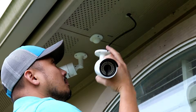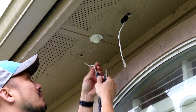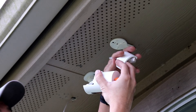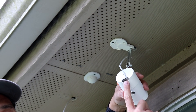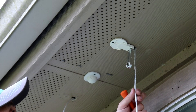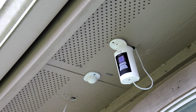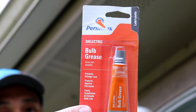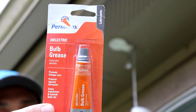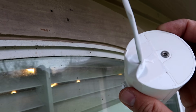Time to install the cameras outside. I removed a couple of my Reolink NVR cameras in my backyard and I'll be using their ethernet cables to set up the stick up cams. In my review video of these cameras — linked in the description — there's one design issue Ring missed: weatherproofing the ethernet port at the back. It has a cover but has a gaping hole, and they should have designed it with at least some type of gasket cover. Corrosion is an issue where I live, and it happened to my old PoE cameras. You can use connector grease or bulb grease from your local auto supply store — I got mine from Walmart — or use duct or gaffer's tape to cover the hole once the cable is connected.